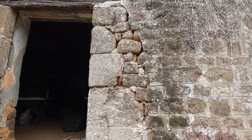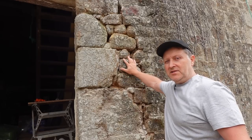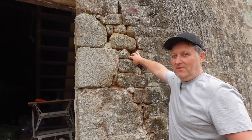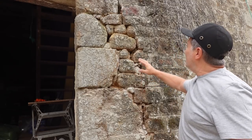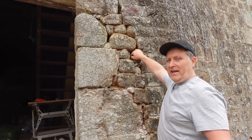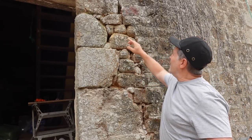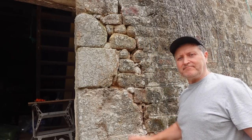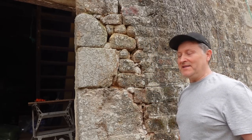This is as much as I can safely take out at the moment. Take too much out and the stones are loose — before you know it, down it comes, well a small section anyway. We're going to get some lime in there, get that all secured, let it go off before I touch anything else around it. Right, let's get this mix going.